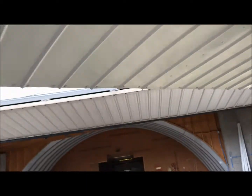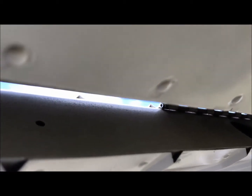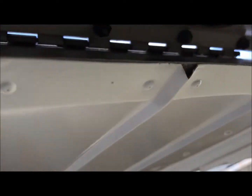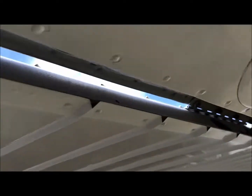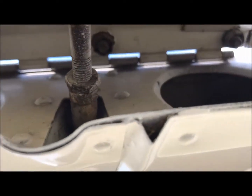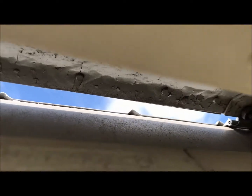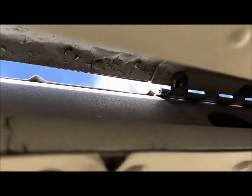The flaps — I did not extend the flaps on the pre-flight, I should have, but I didn't. But anyway, all the connections are there, and the left aileron has both pins and all three hinges. There's no nicks, no bangs, nothing on this airplane on the wings — they're really in good shape. No corrosion; maybe some very minor surface corrosion was discovered at the last annual, but we put some Corrosion X on it and it was fine.